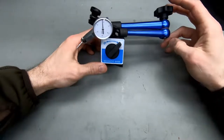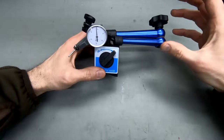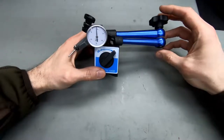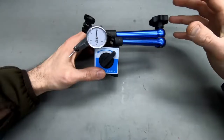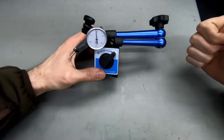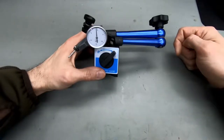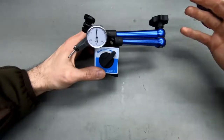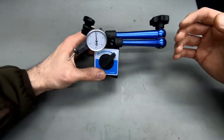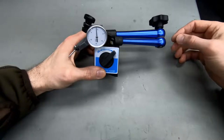I have to say, I made huge progress in my reloading, in the quality of my reloaded ammunition, when I started paying more attention to more consistent handle strokes of the press. I was trying all kinds of different ways of manipulating the handle, like holding it down with force, pushing it down, camming it over forcefully, and everything in between, like doing it very gently. I built a little contraption that was accidentally also measuring the consistency of my press strokes, and that really helped me get my strokes more consistent.